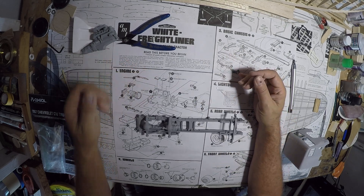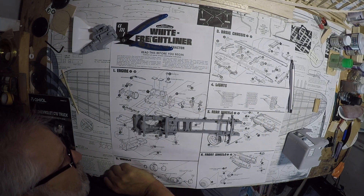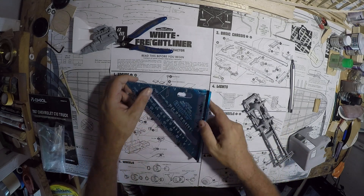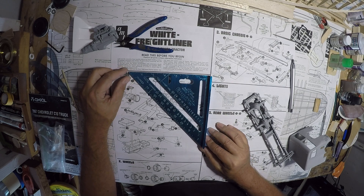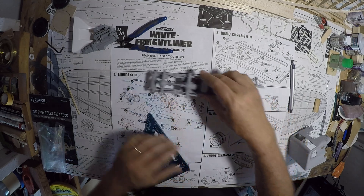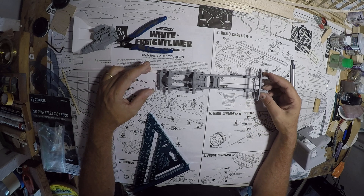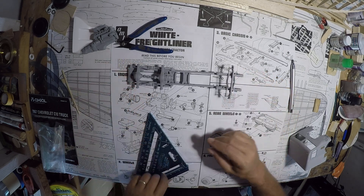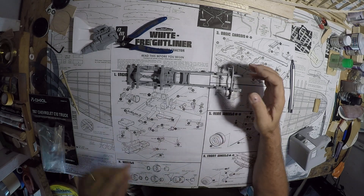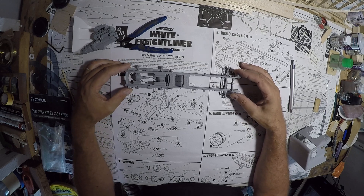The lines on the drawing are drawn at right angles. Get a builder's square and check the lines yourself — you'll see that's a 90-degree angle, and they're all 90. Use what's available to you, get everything lined up nice and square. Don't just guess or go by eye. Even if you've got a good eye, always check. That's how we get the frame built.